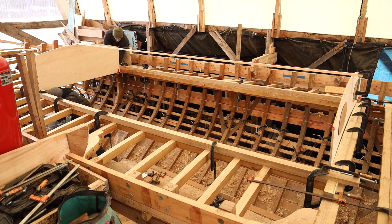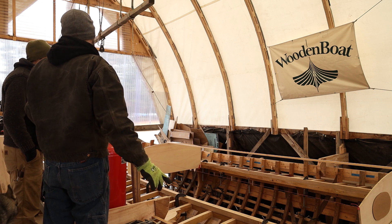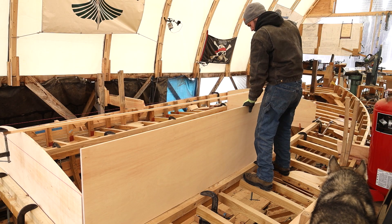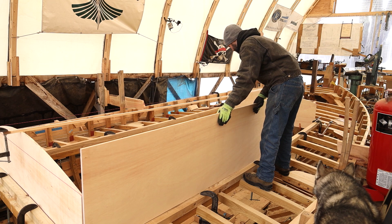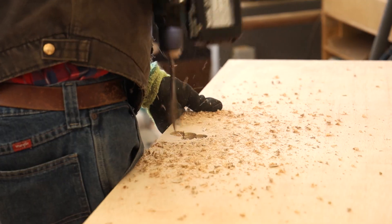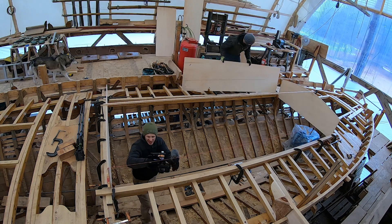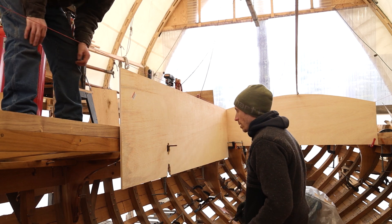The next step is to do the sides. The last panels we put in are going to have to get cut — I've cut them to the longest opening, not accounting for the thicknesses of the plywood. We could take the two long sheets and put them in the stern and butt them up against the string. We can get that screw figured out if we do it that way, starting with the stern. We're going to hit this bolt here, so I'm just going to hack out a bit of a channel there so it'll fit around it. It doesn't have to be anything pretty. Then we can get this one clamped in place and do the same on the other side, and we'll have a real good idea what the house sides look like. Should be able to clamp it in the notch in here. I knew I made that notch for a reason.